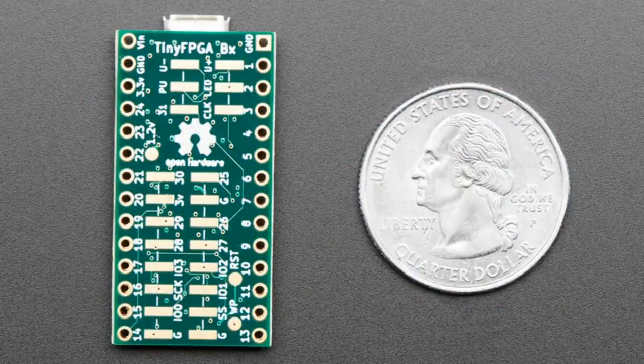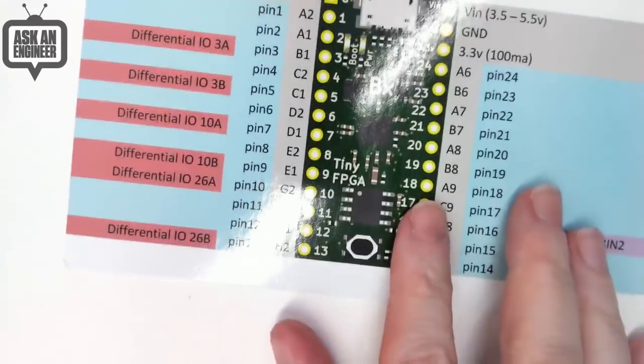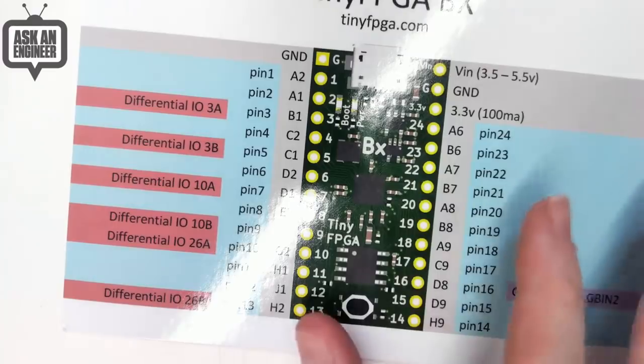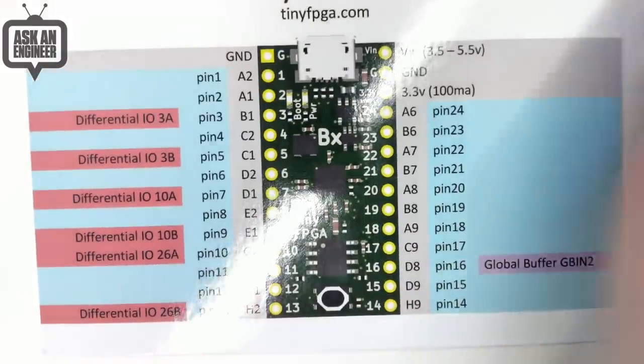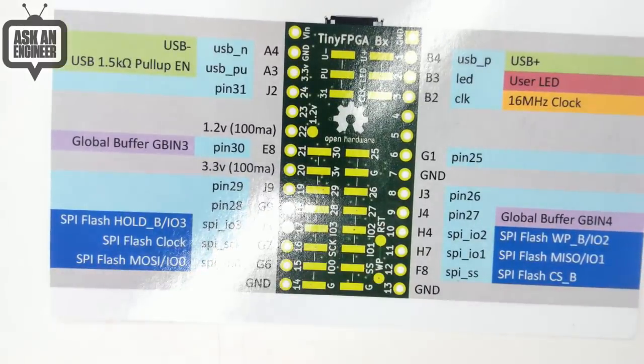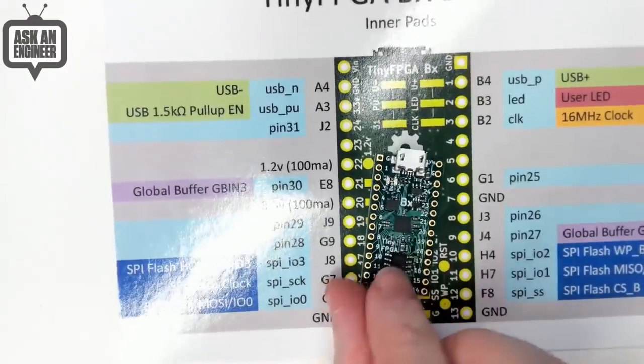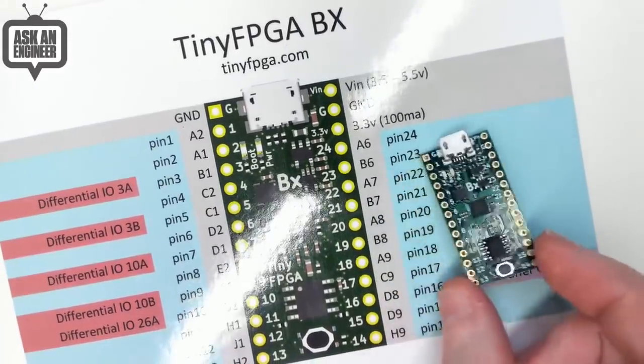It has open-source toolchain support — and it's not thousands of dollars. More importantly, you can run on Linux, Mac, or Windows. A lot of toolchains were restricted to Windows-only software — old Windows software that you hate yourself for using. It comes with a card showing all the pins, powered from USB. It doesn't have analog inputs because it's FPGA, but you can connect I2C and SPI devices to add analog. It does PWM really fast because it's an FPGA. On the back there are even more pins available. It's very teeny. They're also looking at designing a Feather version, so an FPGA Feather could be really interesting. It has a little button — probably reset or bootloader mode — and the bootloader is over USB, so you don't need anything else. This is all you need to get started with FPGAs.